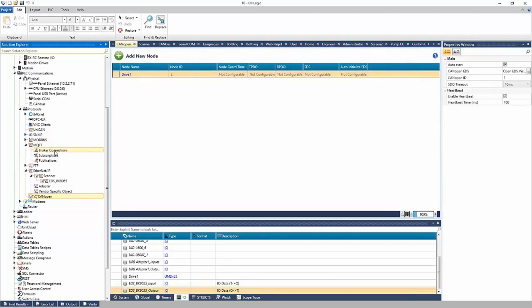MQTT is an IIoT protocol, right? It's a low overhead protocol for communication to cloud platforms, databases, and more. Essentially there will be a broker that collects all of the data, and we can publish topics to the broker, and we can also subscribe to topics from the broker.